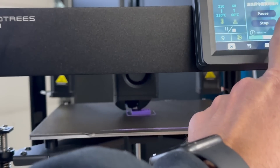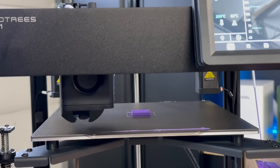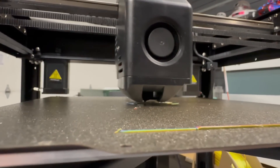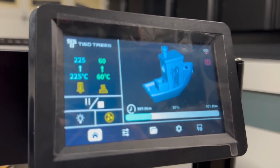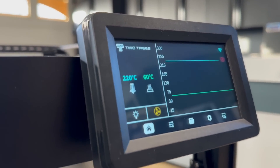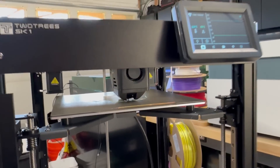This machine vibrates a lot and I had some screws starting to back out — odd, because a lot of the screws have Loctite, but the ones backing out do not. Another issue: when you stop a print, it parks the hot end to the front left, which makes removing the build plate very, very difficult. I'd rather see it park in the right rear or left rear. Next is the display — it's decent, but it doesn't give you all that much information.